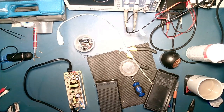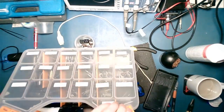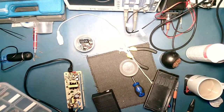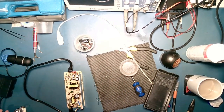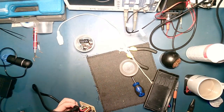Fortunately, and very fortunately indeed, those were 470.16s. Now, this is my pack of caps. This is where I keep my 470.16s. There is one remaining. I do, however, have 470.25s, I think, and I've only got 470.35s, so worst case scenario has a bigger cap in it at the end of the world. Right. Well, I'm glad it went when it did. This is also the reason why I soak test stuff. I usually leave these to run for a good half an hour or so.